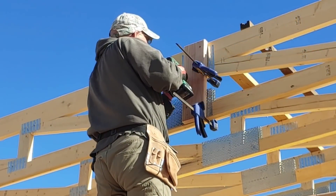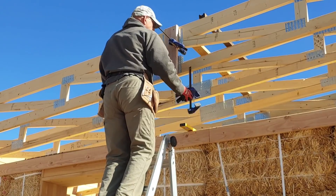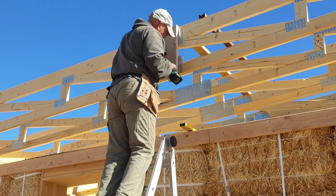Here I need to use multiple quick clamps. I'm screwing through the mending plates on the trusses, and if the board isn't held flush to the truss, it's going to back out on you.